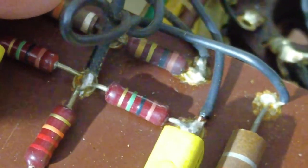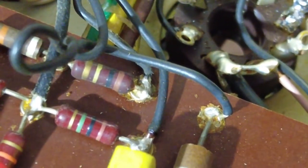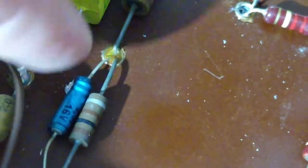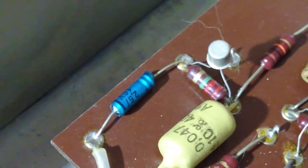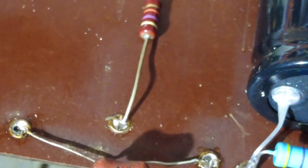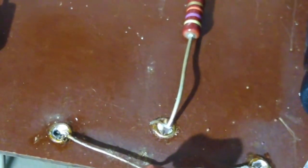There'll be one or two other plate resistors to trace out and replace. There's this capacitor here — something at the back of my mind says about 2.5 microfarad, which is a bit of a weird one, and there's another one of those up there. Then obviously I'm waiting for a cap for the bias which I ordered yesterday. The 50 picofarad cap here tests fine on the capacitance tester — of course you never know what it'll be like under load.